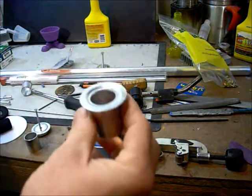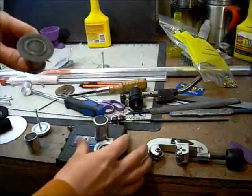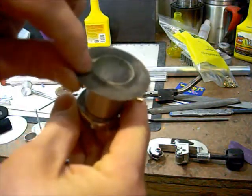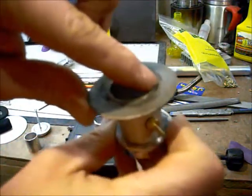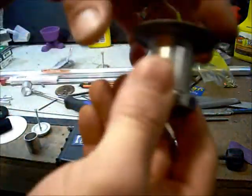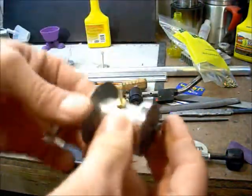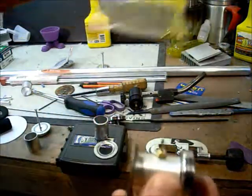The last thing I have to do is JB Weld in the top. As you can see, there's a little bit of an indentation there — that was that flange. The JB Weld, when it dries, I always just make it smooth all the way across, but as it dries it will fill in that flange. So now I have it pressed out, it's on there tight, JB Welded. The pipe actually sticks through this. So the last thing after that would be to drill a hole and tap this and put in my nipple.